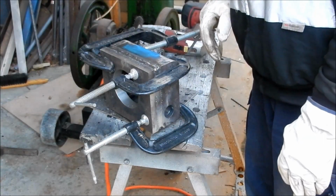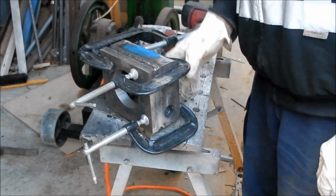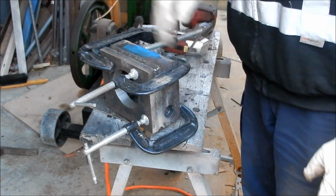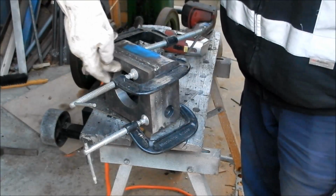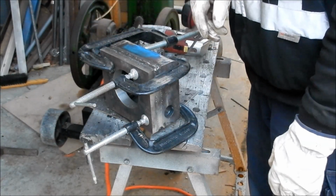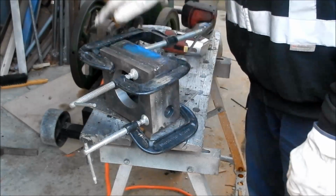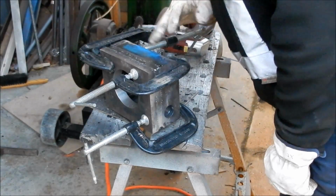And we can set up for the machining of that face whilst I've got that face there nice and flat at the back there, and we've got our mounting holes. We'll just give it a lick across here. That's going to become our datum face that we're going to work from to get everything squared up as a start anyway. Alright, I'm happy with that.